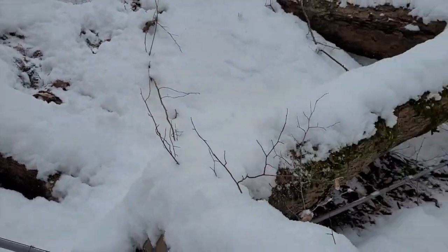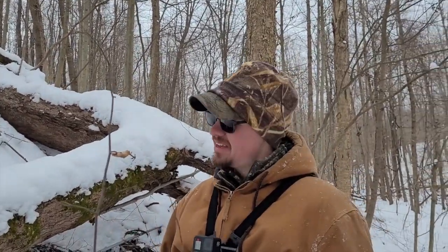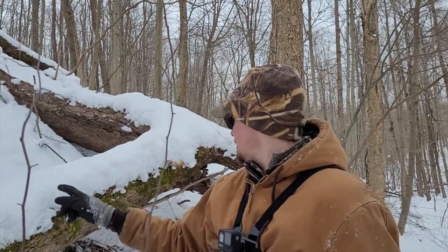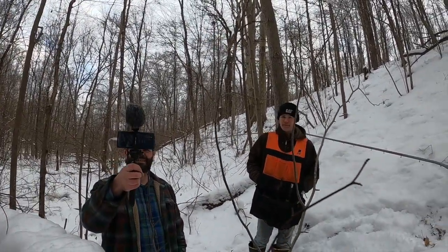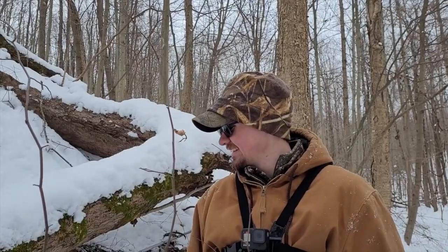So you're saying the main line here is tightened by side tie wire. Uh-huh. The idea is, if you tighten it with a ratchet and a tree falls on it, you're screwed. You just have that tree sitting on your tensioned high tensile wire, unless you want to go clear to the end, let it out, and it's never going to tighten back up even. Now, we pop that side tie, the next one there, this one here, and the next one past it, the pipe will lay right on the ground. There's no tension on the wire. You know what happens when you cut logs when there's tension on the wire? Yeah, they go flying. They probably hit you in the face. Flying right at your face. Yeah. Ask me how I know.